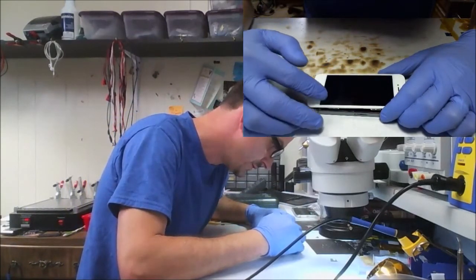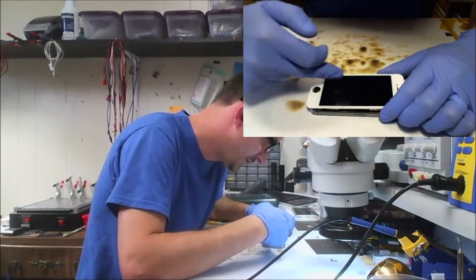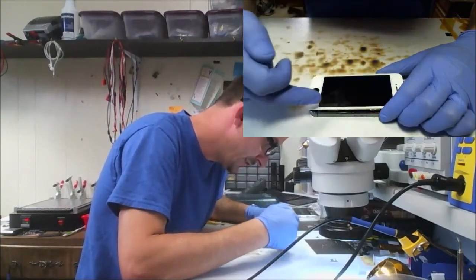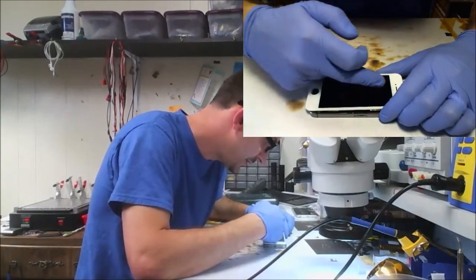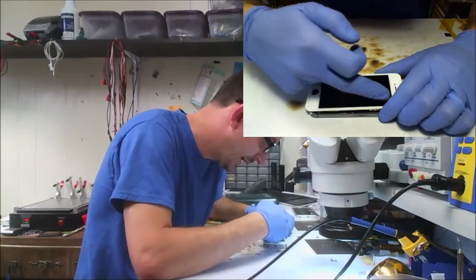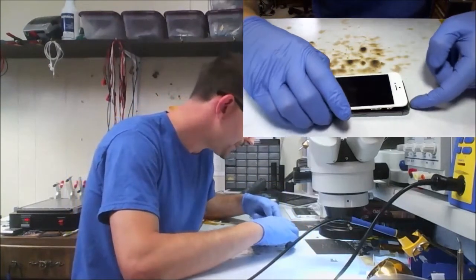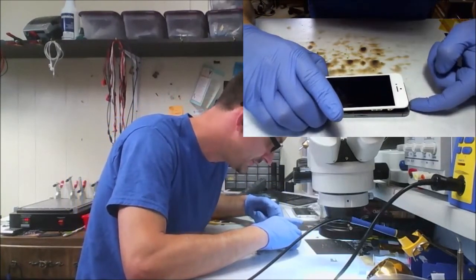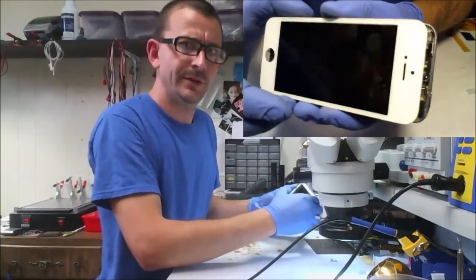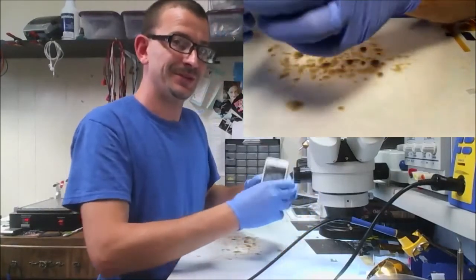Oh, yeah. I can't test everything else on this phone without a passcode, but this is a local job, so if there's any other issues, they can bring it back. There was no other problems with this phone before the screen replacement. I know I didn't get anything too hot doing the connector, so I know this connector is going to be good. So my next step here is going to be ultrasonic cleaning. And I don't know if you can see the screen or not, but I do have a slide to power off. And we're powering off, so successful digitizer connector.